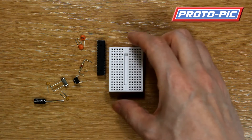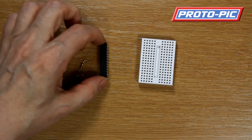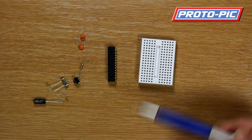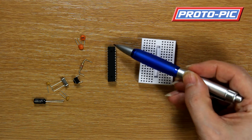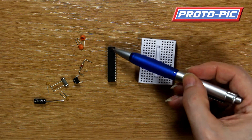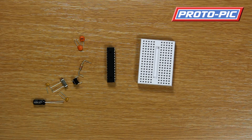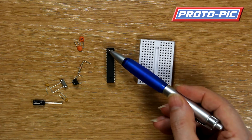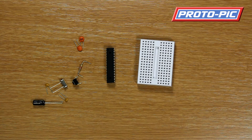The way you put this kit together, there's a key feature you need to know on these chips, and that is where pin 1 is. This is marked with a divot — here's a close-up of it. This denotes pin 1 on the chip, and it goes from pin 1 down to pin 14, then pin 15 up to pin 28.